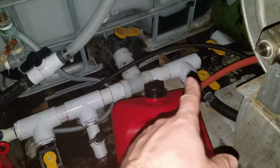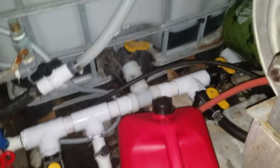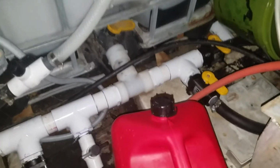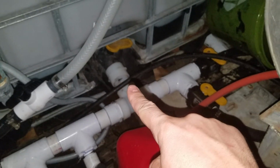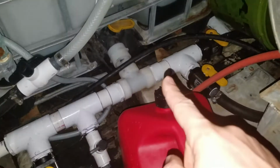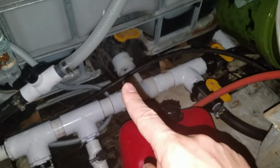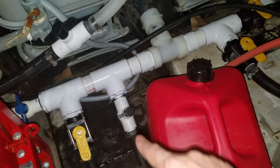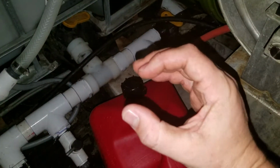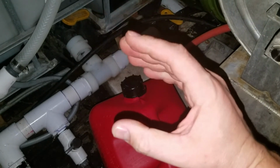The other big thing, I see too many times when people are trying to plumb up one machine, is that instead of going 2-inch for a while out here before reducing to 1, I'll see a lot of times people will take a 2-inch coupler and reduce it immediately down to 1-inch, or directly to 3/4 inch. Just imagine, if you've got all that water flowing through there, which one's going to give you more flow? A big hole or a smaller one?